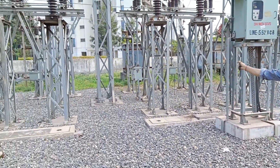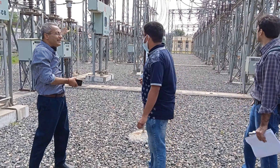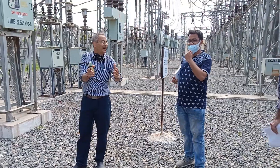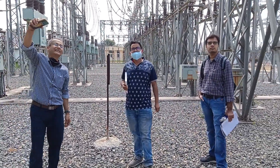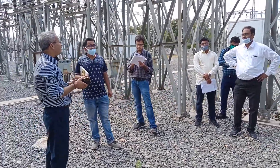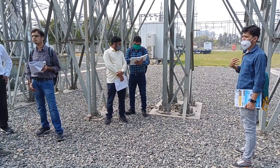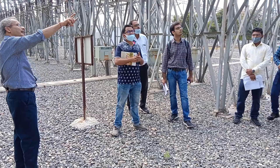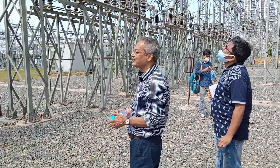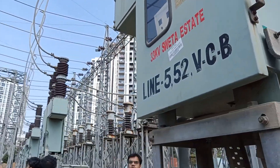When the line is going, there is a cable — underground cable or overhead. They are carrying power from the interior. In engineering, we don't need heavy design and heavy engineering — only optimization. So this is the beauty of engineering: optimization. You can see how much clearance is there — hardly 5.5 meters. There are certain provisions. Section clearance is so low that when you work, the operation and maintenance people should be safest during their working atmosphere. That is the purpose of the clearances.